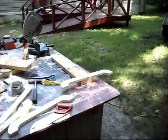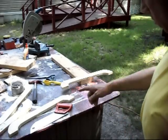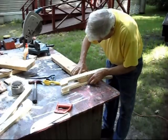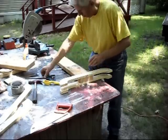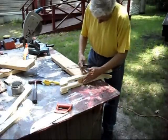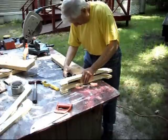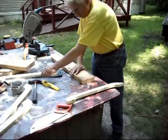Okay, what I got to do now is, I got them all measured out and marked properly. So I'm going to commence to glue and nail these in. One on this side, I marked the insides. Center on the 2x6, and we go by the squareness of this, not this, simply because this was not cut precise. So if you want the real precise angle, we got to use the 3/8 here. And what I'm going to do first is put this one on.